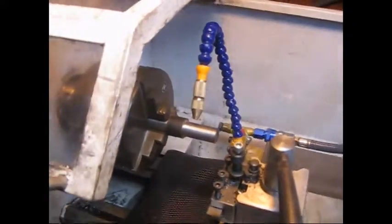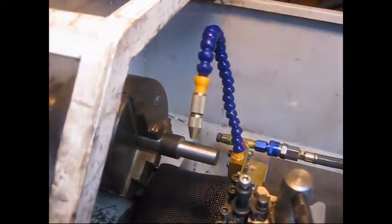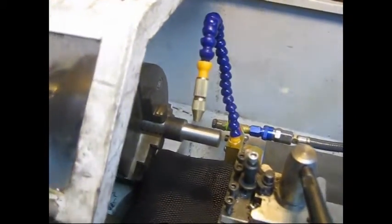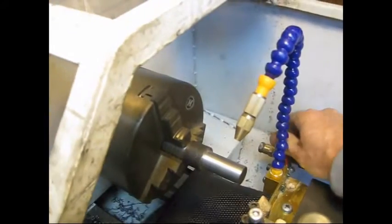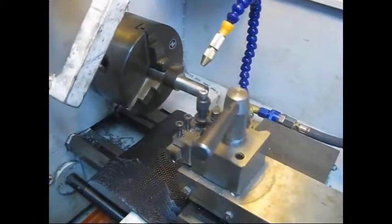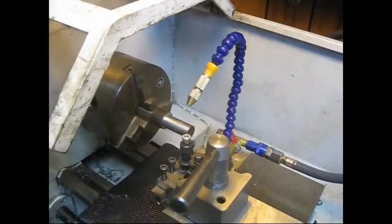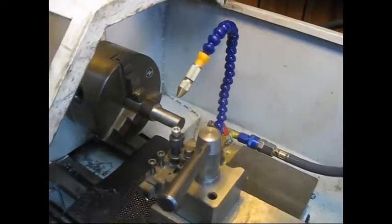The only issue is that it's not very good really. The problem is that to get it to work you've got to use so much air that you just get a torrent of the fluid coming through, which just gets a bit messy and is pretty unnecessary. So you see there's very little regulation or control — it's all or nothing. It sprays everywhere, and I think the biggest issue is that because it works on a venturi effect and sucks the air out of that bottle, you can't really regulate it too well.